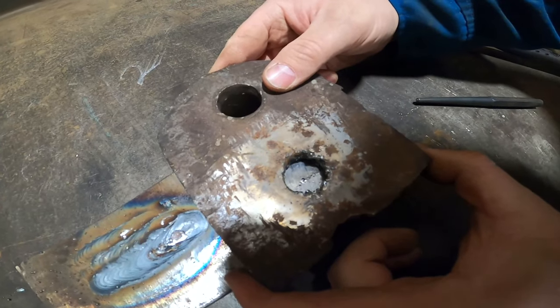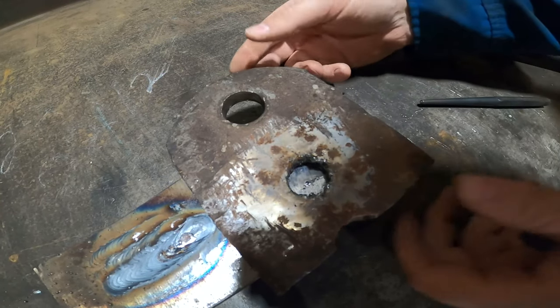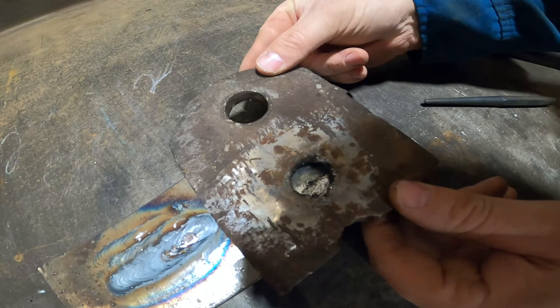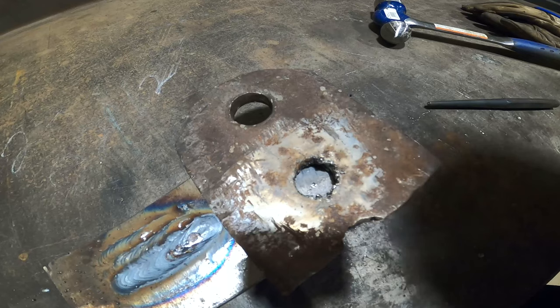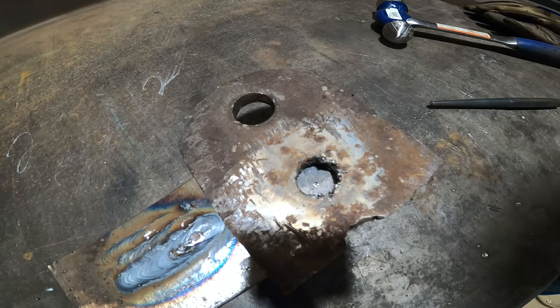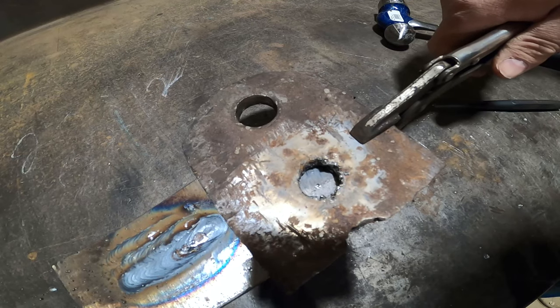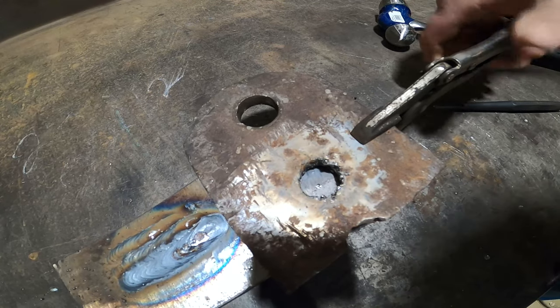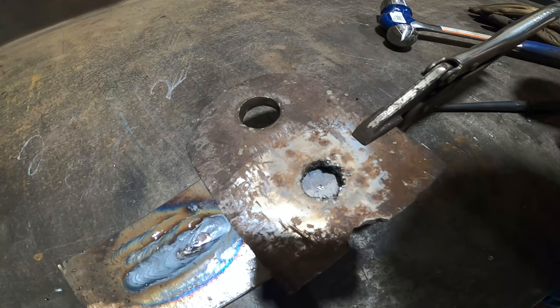Then what you do is line up your plate so it's right in the center. It's not going to be 100% accurate, but you can probably get about 95% of the way there with just visual measurement. Next, you clamp it to your axle — you're probably going to use a C-clamp or an F-clamp or something like that. That's just so it doesn't move when you're welding, because if it moves you're not going to be perfectly centered.